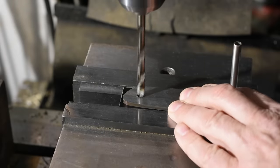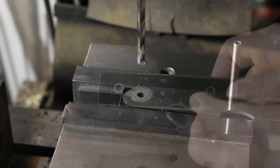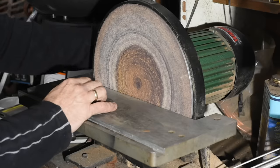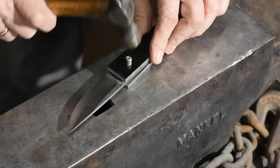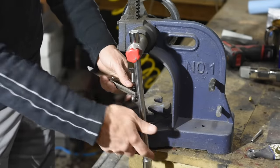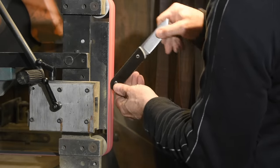That's the key here — those holes have got to be dead square, dead straight, and in exactly the right place. You want to make sure that the front edge is situated where you want it, and then it's been profiled however you want it. Then in go the rivets. I'll grind off the excess and profile everything to shape it to its final shape on my belt grinder.